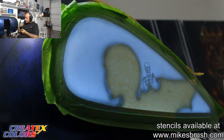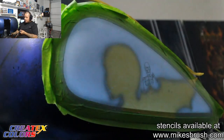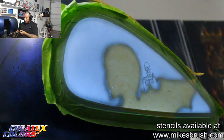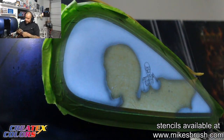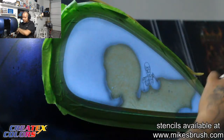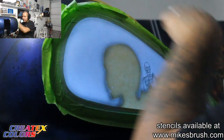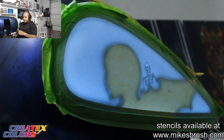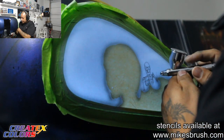And the other thing too is that you can make them flash, right? So you can make it do this flashing thing. Now this is just running off of one of these little tiny inverters. They do sell nicer inverters than this, and ones that make it do pulsing and stuff like that. What you can do is lay one light field, do your designs on that, and then lay another light field around it, or even on top of it. If you separate it out with some clear, you could lay another field over, and have one field flashing over the other.